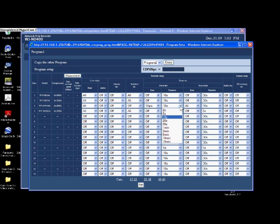People always ask why you would set the pre-event out to 3, 5, or 10 minutes. If you had a field in front of a parking lot where motion triggers in the lot but someone was coming from the field, you could set this back so you could see where that person was coming from prior to when the alarm went off. That's the use case for longer pre-event times.